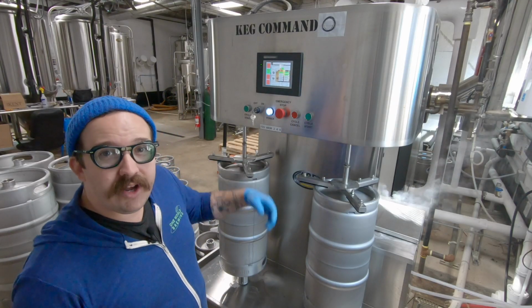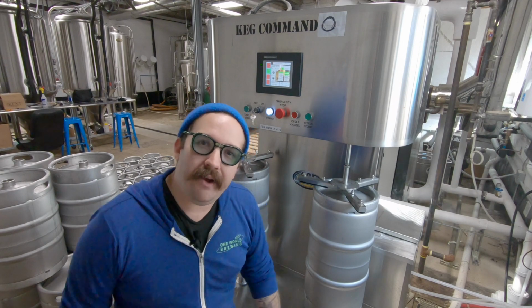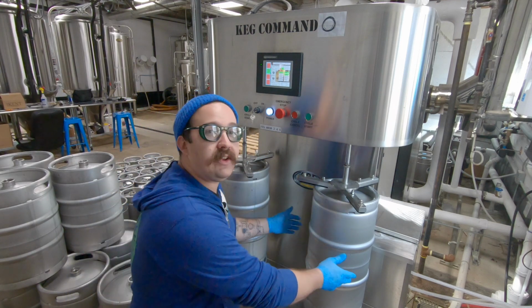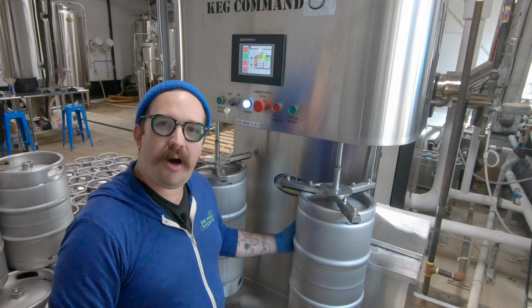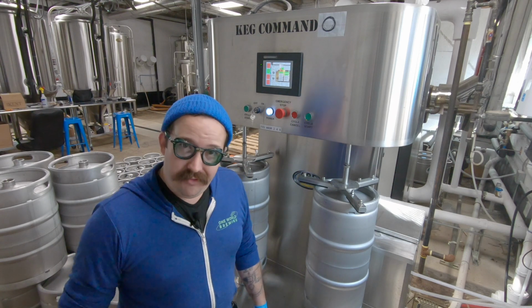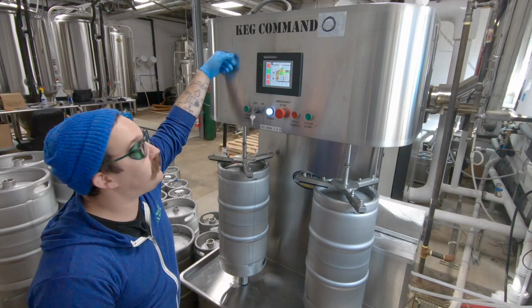Next thing up, not wash cycle, rinse. All right, it's gonna rinse now. It goes to a low rinse to rinse the spear, and then a high rinse on the outside of the keg. That hot keg is turning cool now because it's being rinsed with that cold water. Nice. Now I can touch them without burning myself. I want to make sure that rinse is going long enough to get that caustic out of there. You don't want no caustic left in them kegs. Now it's draining out.